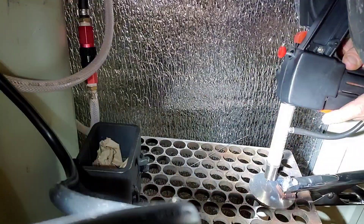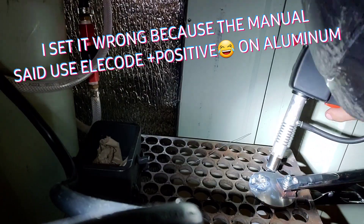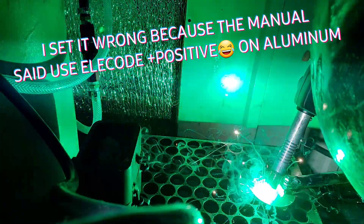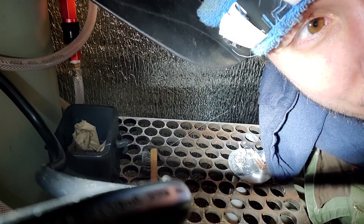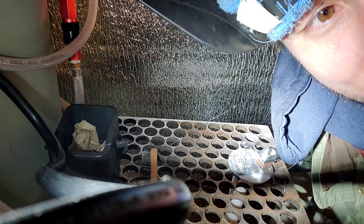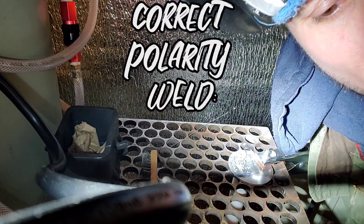Can it weld? We could test it — 220. About 19 and a half volts. Aluminum is electrode positive, like steel, where the ground is negative. But on this machine, in the manual, it said otherwise. That's why I did what it says, because I didn't want the machine to hit a bad error if it needed to ground when it was powered that way.